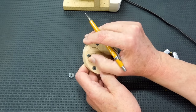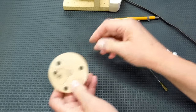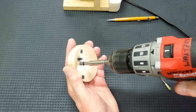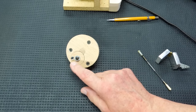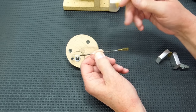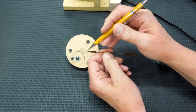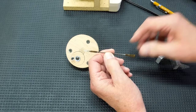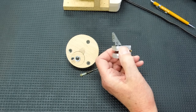This position gives me very little deflection; this gives me maximum deflection. I've been running about here. There's a screw and a washer that lock that in place. Between the eccentric adjustment and the adjustment on the connecting rod — I have a clevis back here on a threaded shaft, and there is some adjustment at this ball socket joint. I tend to leave that alone because these fittings, after being heated to be soldered, are often very soft and can break pretty easily. There's a control horn from a model airplane, like what you'd use on an elevator, aileron, or rudder.